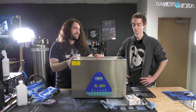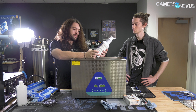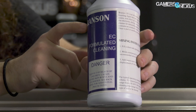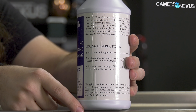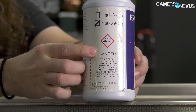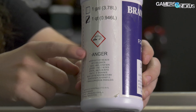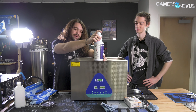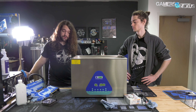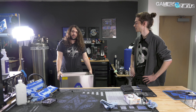We're going to try to do it without actually getting our hands dirty. We're just going to pull the blocks off, submerge them in distilled water, and add this — which a viewer recommended to us in a stream. Feel free to leave your comment below. This is a Branson EC — Electronics Cleaner — formulated cleaning solution. It's got a danger warning on the side. Our viewer recommended 3% to 4% of this versus distilled water for the rest. We're going to give it a shot.